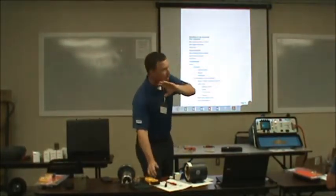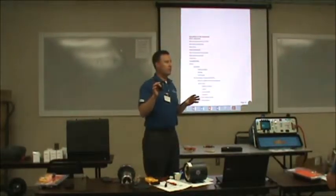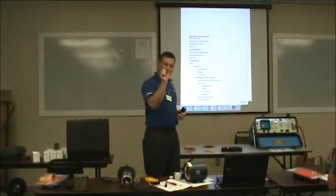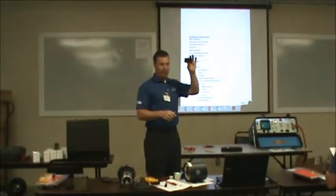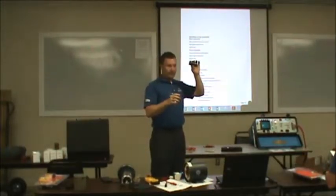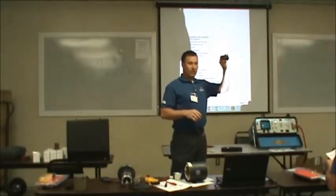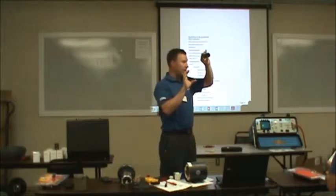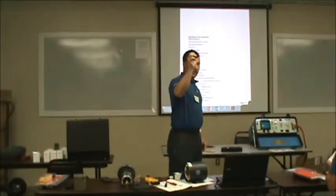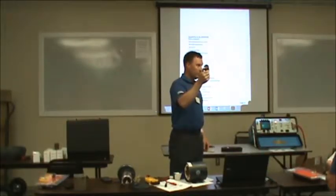Okay, let's talk about a starter relay. Everybody know what a starter relay is in a pump panel? It's a little black box that you see in control panels. We're talking about testing the capacitor on the pump. Remember we talked earlier about the single phase motor, the centrifugal switch opens up at, say, 1,000 RPM. And when it does, it drops this capacitor out of the circuit. If this thing stays in the circuit for a couple of seconds, it's going to blow.